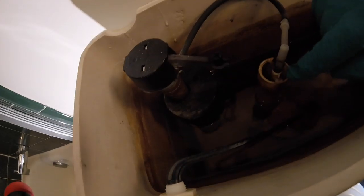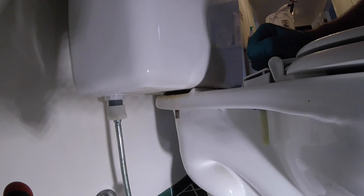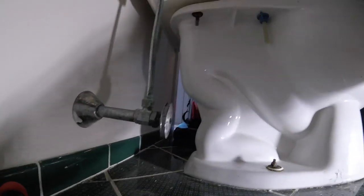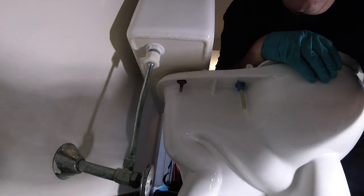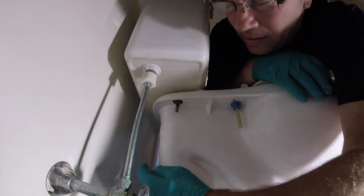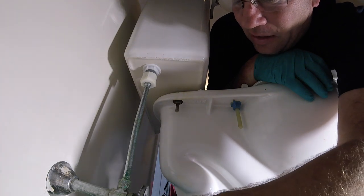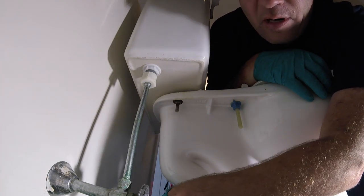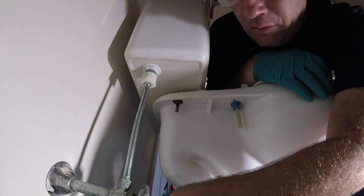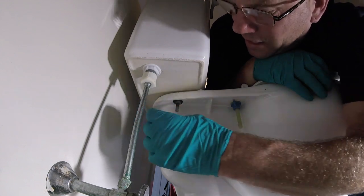This piece here is the flush valve — there's a gasket between the bowl and the tank that sometimes goes bad. What happens is you'll have a leak between the tank and the bowl, and a lot of times you can't even see it. You'll see a drip of water coming down the back of the tank and onto the floor, and you might think it's the bowl wax. Make sure you check the flush valve gasket between the tank and bowl.